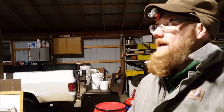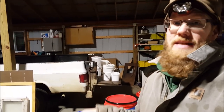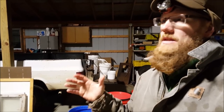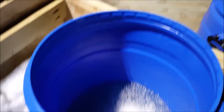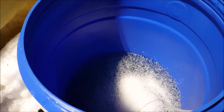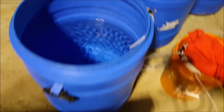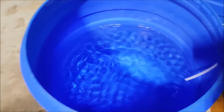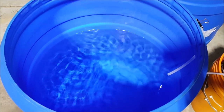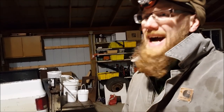Good morning! It is bright and early the next morning. I ran the RO for right around nine hours, so I've got to switch this out and head on to work in a little bit. It's wee hours of the morning, but it's been about nine hours of runtime. Let's see what that barrel looks like now. You can see that is my sap barrel — a little foamy, but that would settle right out; it's just got a little splash coming in from the sap still dribbling in. You can see that is my RO water — it's definitely dribbling, pulling less water out, but it's still very much concentrating.